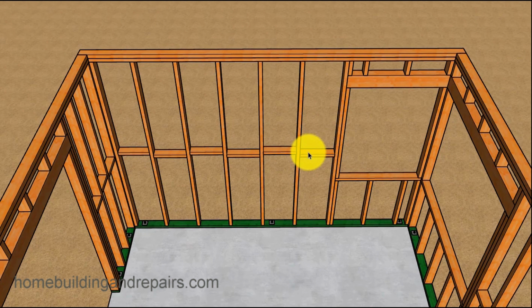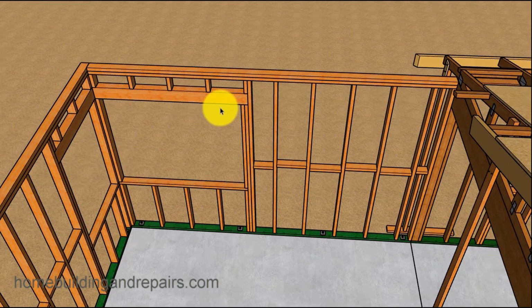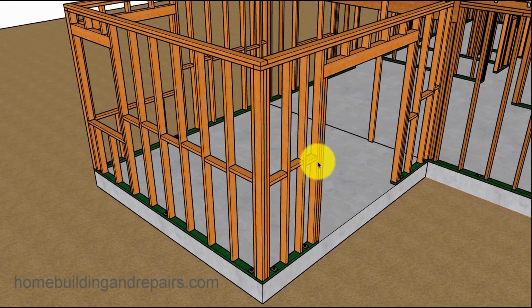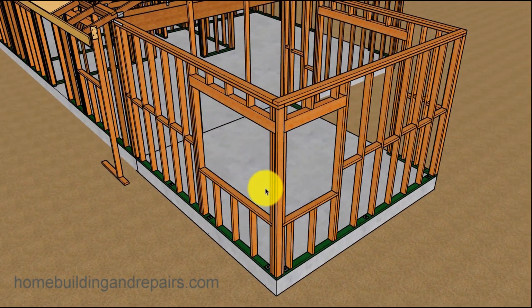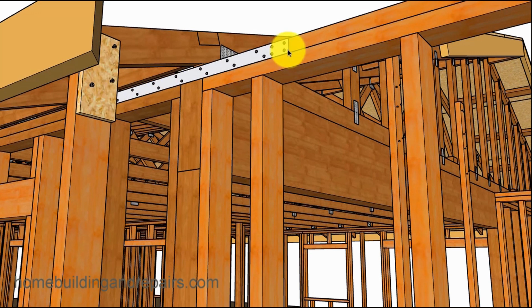And then the blocks coming around, anchor bolts, our window opening. We have a 3-foot window here with a corner window that's going to have trimmers in it. Trimmers at each corner. 5-foot window here, blocks coming all the way back. View of the outside. What the corner windows would look like. And of course another strap here tying everything together.